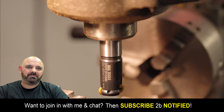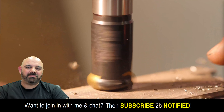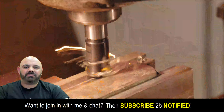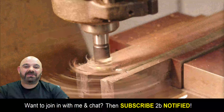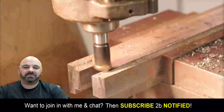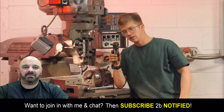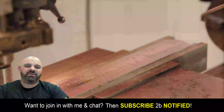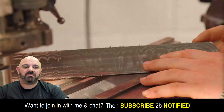I'm going to try this small 20 mil indexable face mill first, 0.7 millimetre depth of cut — first impressions, that seems totally fine. We've got sparks. One of the things I noted as a concern with titanium is that the chip gets so hot that it sticks to the carbide insert. The sparks went everywhere — that is terrifying! Looking at the inserts, they definitely wear quicker than they do on steel. You can see the layers just from the machining — the different layers are cutting differently. Hard to get good surface finishes, but I just care about getting the oxides off.